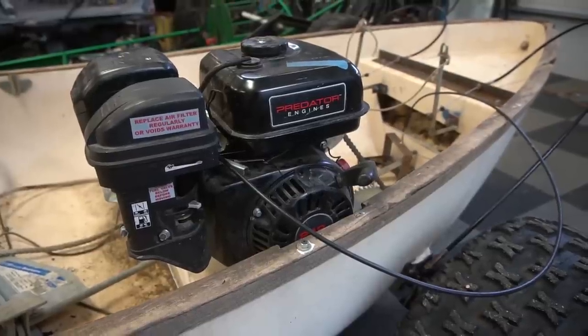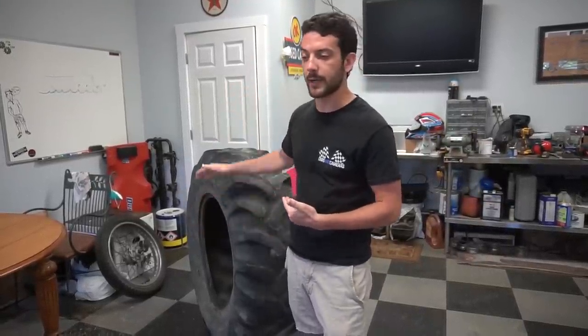We've been having problems with it smoking the belt already. Basically, by making taller tires, which is what it's gonna do, it's gonna act like a taller tire on here. It's gonna be like putting a smaller axle sprocket on it. So it's potentially gonna raise the top speed even more. So we're just gonna have more problems with smoking the belt. The other big challenge is, of course, actually installing it and making it work. So let's get into it.